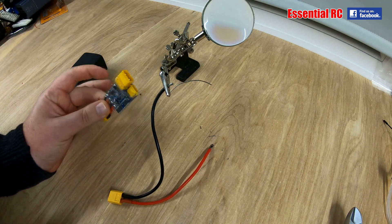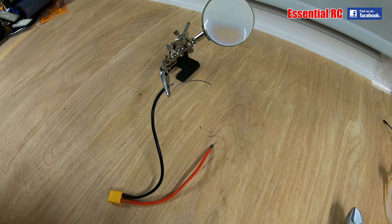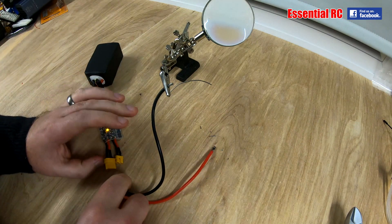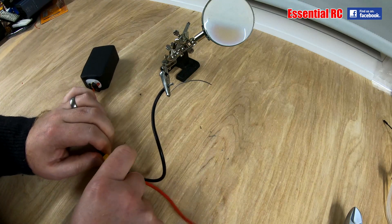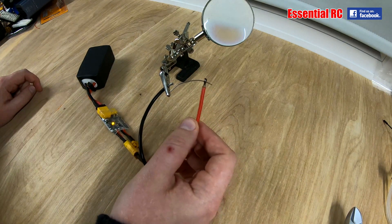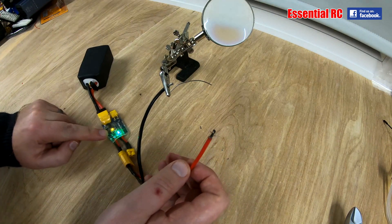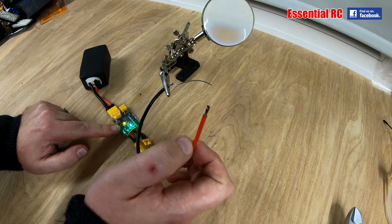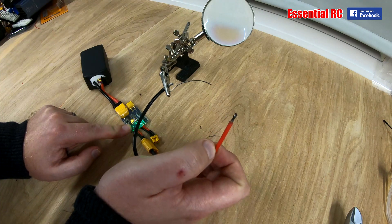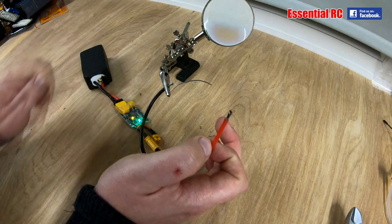Here is the Short Saver 2. We're now going to plug that into the LiPo. As we can see, the light is currently orange, which means it's off — it's not allowing current to pass through it. If I plug this in with it turned off and try to create a short, absolutely nothing. If I then turn it on, its default current is one amp. However, if it sees a short circuit it will turn off within three milliseconds, which is pretty impressive and quick. That's going to protect pretty much anything that would burn out on an ESC immediately.